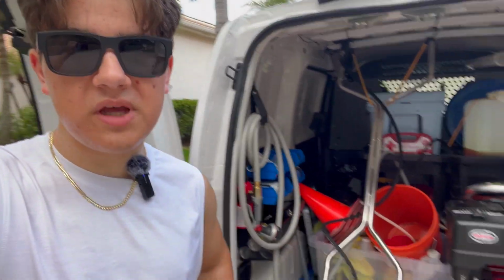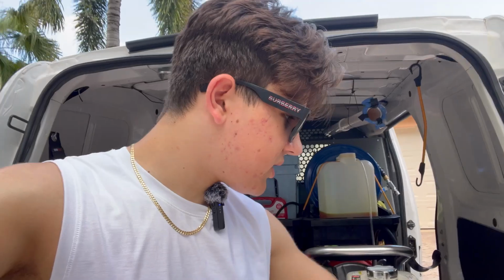And when you're done, if you're using an electric engine, you don't have to worry. You can just shut off the water and then switch. If you have a surface cleaner, you can switch to your surface cleaner. Otherwise, you can switch the nozzles on the pressure washing gun. For me, I have a gas engine, so typically how you would go about switching the nozzle or the tool is you would switch off the engine.